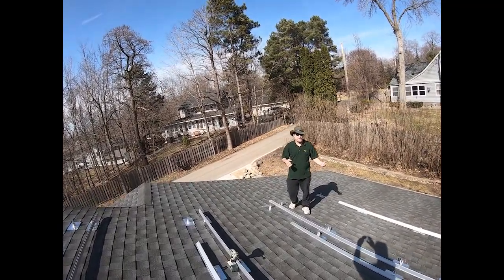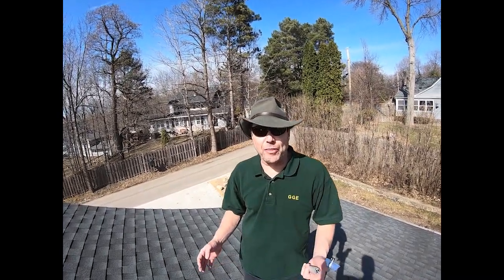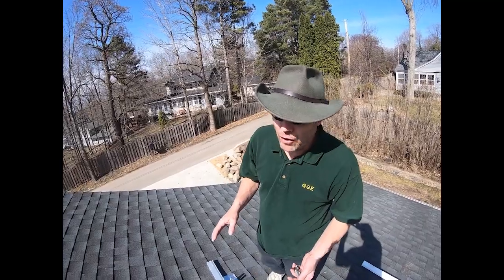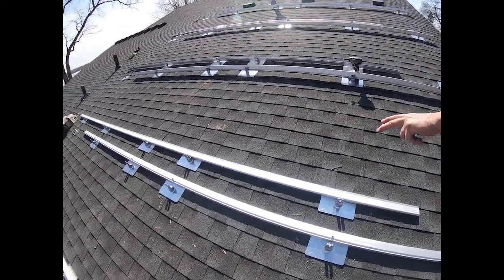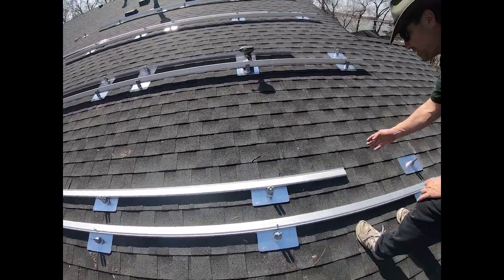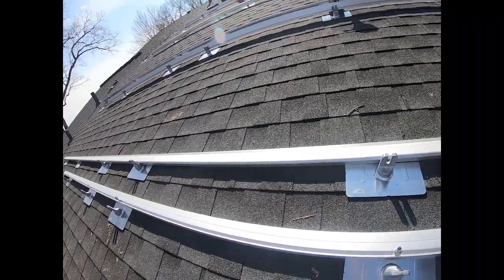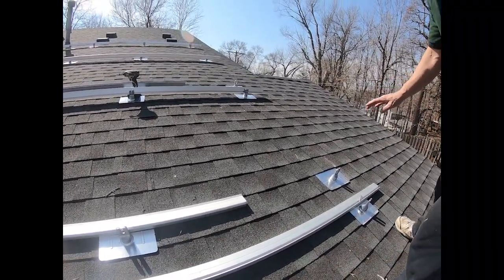I'm on the other side of the roof now. I got all the flashing in place and brought the longest rails up, set to go in the brackets. The first thing you want to do is line them up — one one way, the other the other. The big reason is because where you end up having to join them, you want to have the breaks on different parts. You don't want the breaks at the same spot on every rail — it's about structural stability.